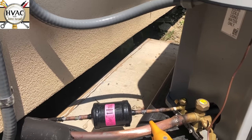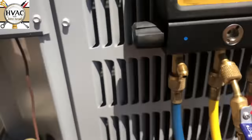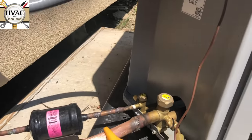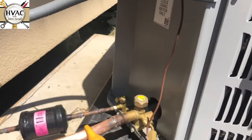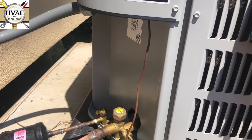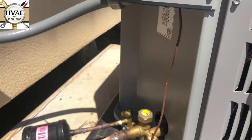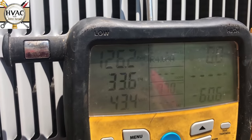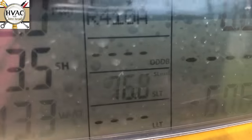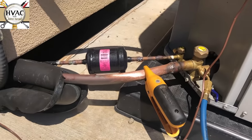410A — you can see the superheat is high. I didn't hook up the high side because I'm just getting ready to pump it down. The subcooling is at the manufacturer's specifications, so that's why I recommended getting rid of the valve. If I hooked up the subcooling it would be at about 10, and with a 33-degree superheat and line temperatures at 70-something degrees, it's just not keeping up on a hot day.